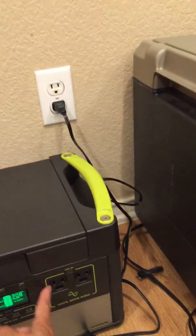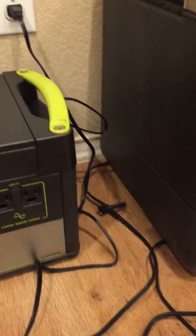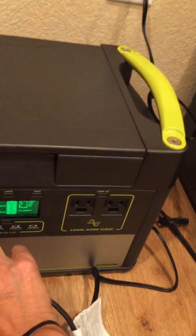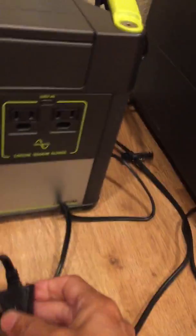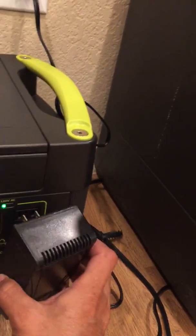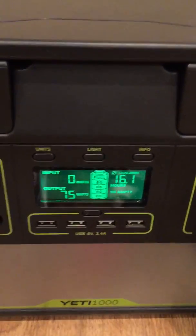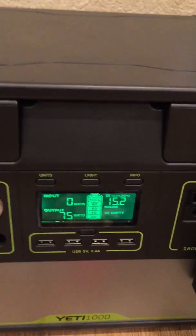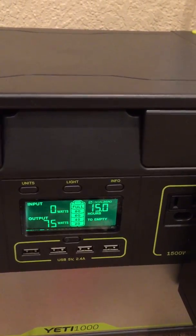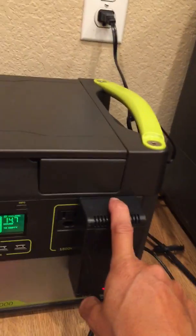To show you that when you have two items that can go either AC or 12-volt, you want to try both to see which is better, because they are sometimes considerably different. Here is my AC adapter for this. I've plugged it into the 110/120 outlet. The 12-volt was going to go down to about 50 or 51 watts. This AC version is going to hover somewhere around 75 to 80 watts — let's say 75. So that's 25 more watts of power being used going through the AC portion.